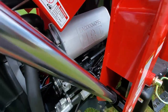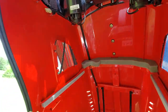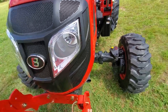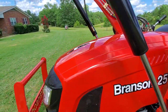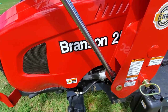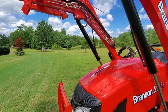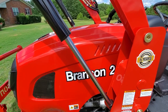Just a muffler — that's awesome. Working headlights. Hear that click? That's the hood closing all the way. Yeah, that makes me nervous with the bucket up in the air like that. But it's easy to make safety braces — just angle iron cut to the length of the cylinder open, zip-tied shut so the cylinders can't close. That's how they do them at the shows and if it satisfies insurance liabilities it should be fairly safe for working under the hood.